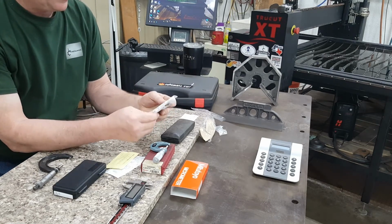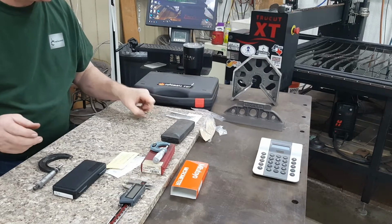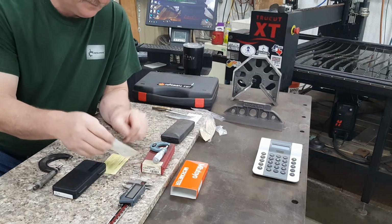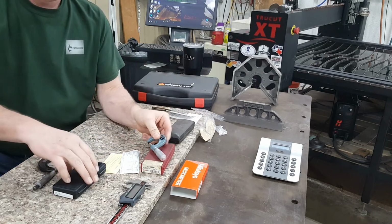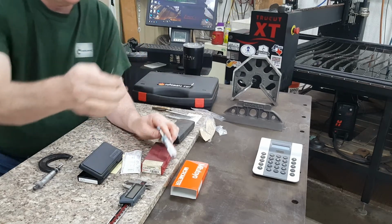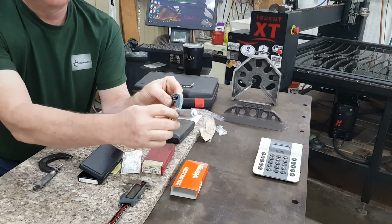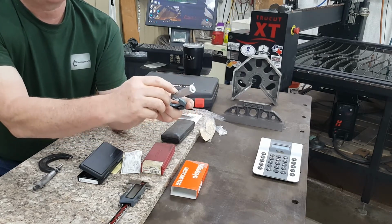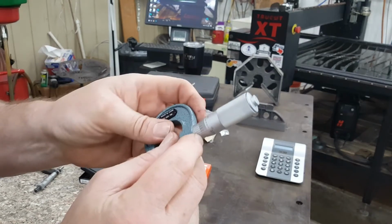And I don't really want to read all this, but in case we've never, I only learned how to do this not too long ago, probably in the last year, or if I knew it before, I forgot about it. The way you calibrate these, there's usually a little wrench that comes in the box. Now, these should be calibrated already, but this little wrench, on most micrometers, there's a little hole right here so you can hook this wrench in. And when you make sure you know what you're doing, you can crank on this little part here that it lines up onto. So that's where the tenths come in, right in here is where you line this up.